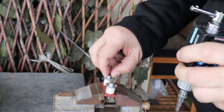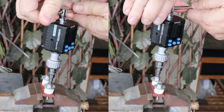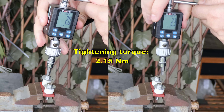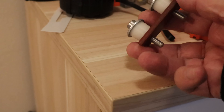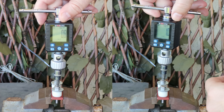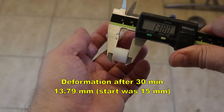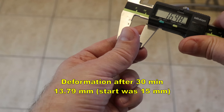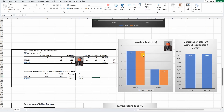Stress relaxation test — I call it the washer test. The washers are tightened with 3 rotations on an M6 bolt, which is 3mm of tightening. I measured the tightening torque, then after 1 day measured the untightening torque — in this case it was completely equal at 1 Nm. After 30 minutes I measured the permanent deformation, which was around 13.79mm. In this test it was extremely similar to the average TPU 95A.